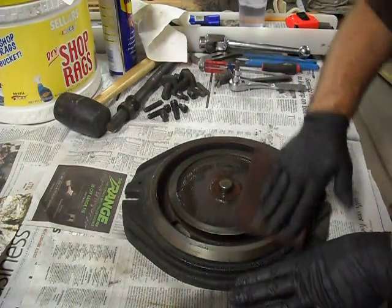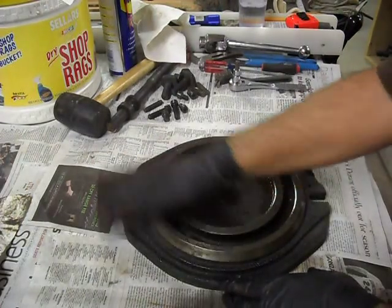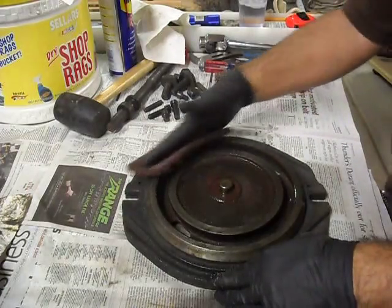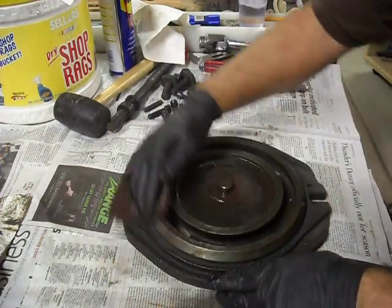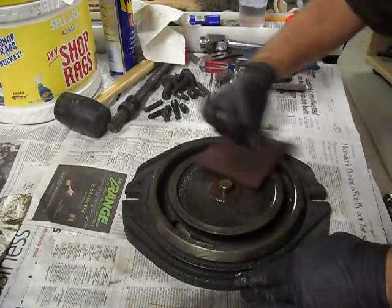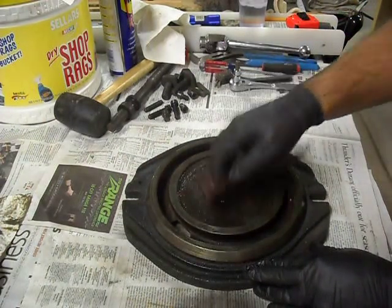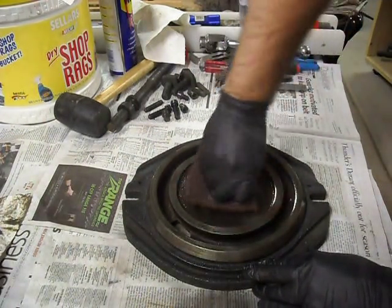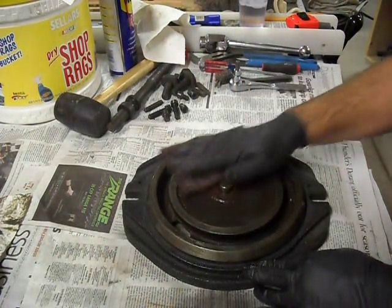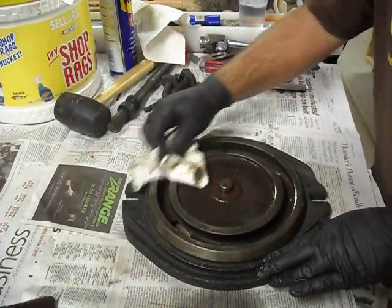And once you've done it a couple dozen times, tramming in a vise isn't actually that difficult. It's just like setting up a four-jaw chuck. You know, if you watch a number of people on YouTube, they spend almost every day setting up work in four-jaw chucks, because you can get really accurate with them. And yeah, they'll tram it in, in a couple of minutes, if even that.